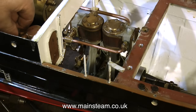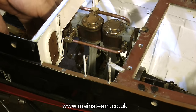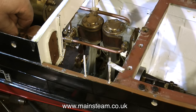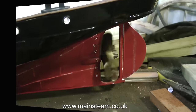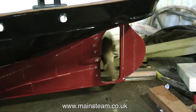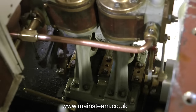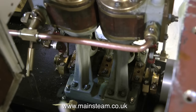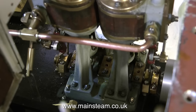Here's another shot of the engine with the camera's microphone in a different position, so it sounds a little different. This is a very well-built engine by a very experienced model engineer, and it always did run well. I quite look forward to running it on steam. If you look at the universal joint on the prop shaft, you'll see there's a slight gap — this is intentional to allow for expansion and contraction of the crankshaft. When I drop the pressure — and there's really nothing showing on the compressor gauge — it goes very slowly indeed. This proves that the transmission is fine, it's not binding much, nothing is tight, and it works well. There's an internal gland nut that should stop any water getting into the boat, and I'm very pleased so far.